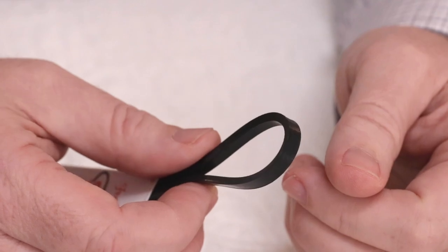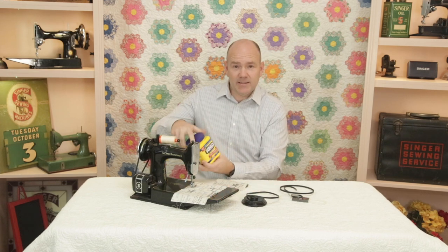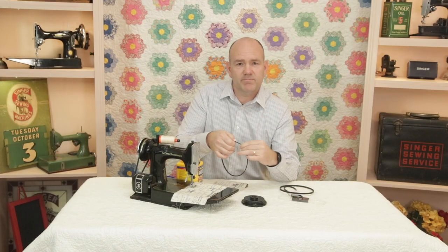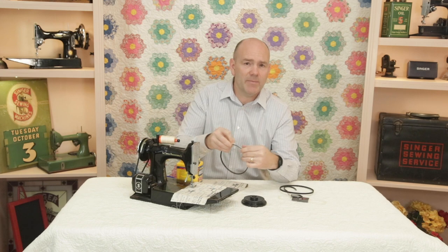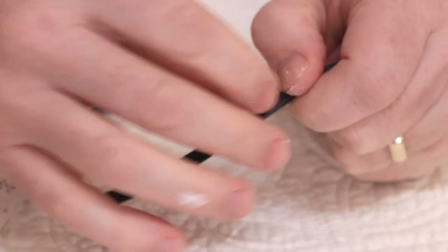The good news is there's nothing wrong with the belt. If this happens, there's a really simple remedy: just add a little belt dressing to the belt. The Superbelt already comes with belt dressing on it, but if it's been wiped off or if the hand wheel has some cleaner on it, you may need to add a little extra. You may be wondering what belt dressing is and where to get it — well, there are many types of commercial belt dressings, but you most likely already have some in your kitchen. Just a teeny tiny pinch — and I mean really, barely any at all — of cornstarch spread around on your belt will reduce that friction and keep the belt from climbing in the hand wheel. Not enough that you even see any powder on the belt, and you can even do this while it's on the machine.